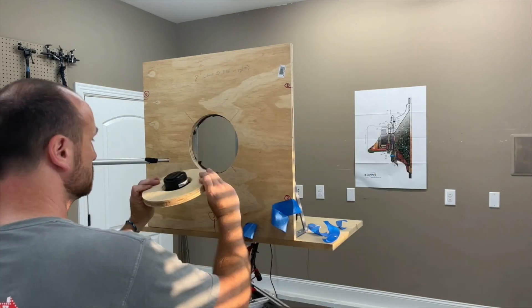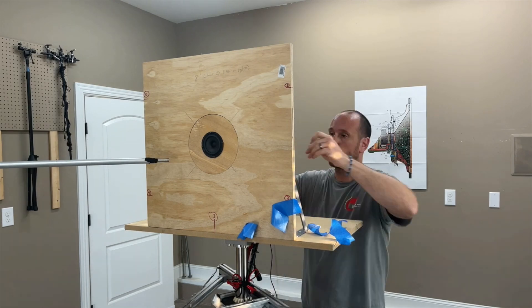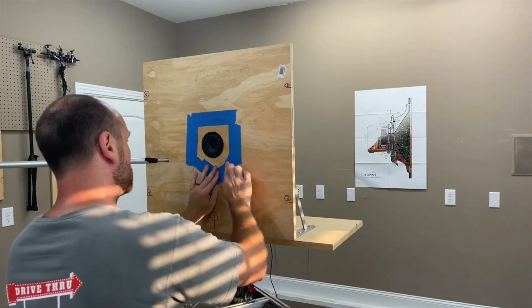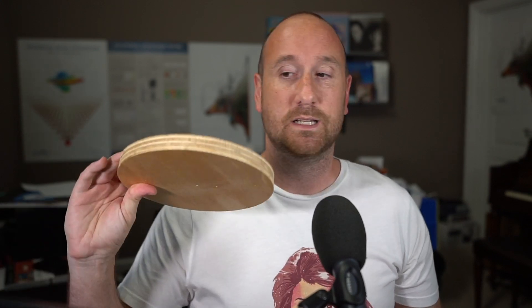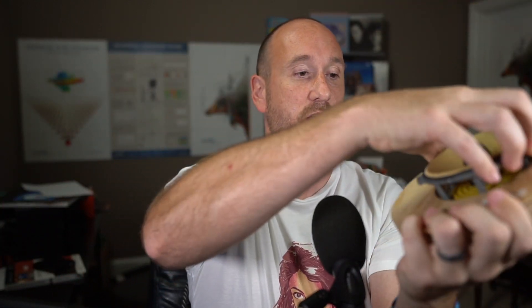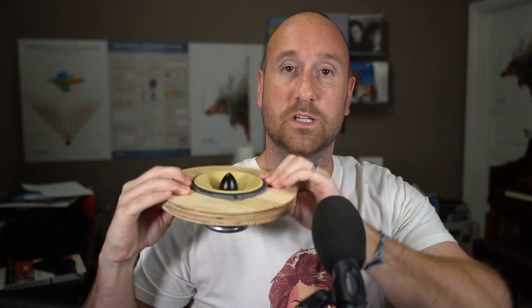It's similar to what I had before, but this time I've cut out some round circles and I'll have different size baffles depending on the size of the drive unit that I'm testing. That makes it a little bit easier when it comes time to test different size drivers. For a large woofer I'd use a different size, but I'll mainly be testing smaller drivers so I don't need as big a baffle. In this case I'm using about two feet by two feet - maybe 0.6 or 0.7 meters. I make little face plates; this one is about an eight-inch diameter circle, and I cut out a smaller circle to mount drivers to, then put it onto the baffle and tighten it from behind.